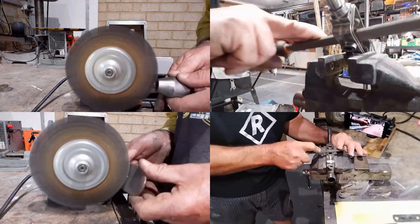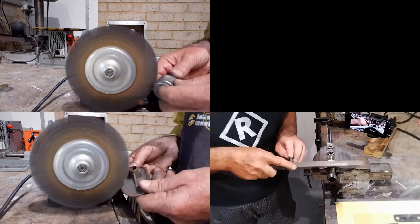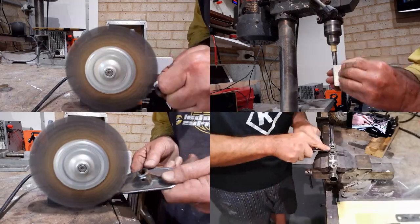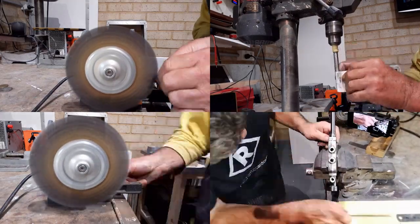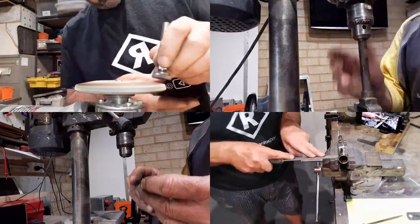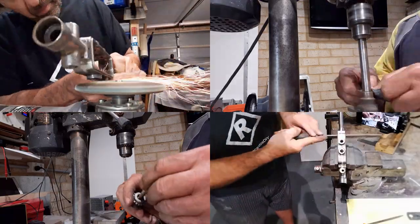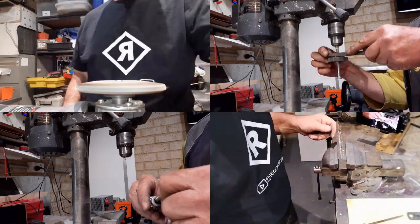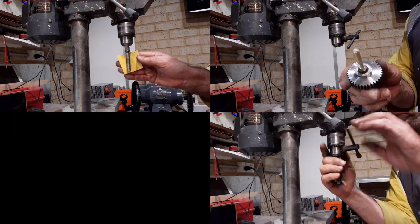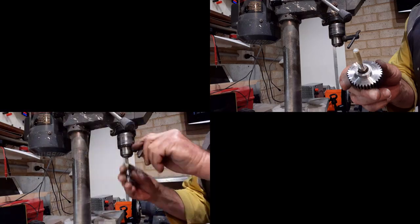This montage demonstrates the various techniques that I've employed for the drill. I am primarily interested in achieving the following results. 1. All tool casting marks, both on the outside of the tool and inside the gear housing, removed. 2. All rust removed from the gear shafts and polished to a satin finish. 3. All externally visible non-painted metal gets polished. 4. All casting marks removed from gear assemblies. 5. All surface rust removed from the drill body. And finally, all the screw heads are polished.